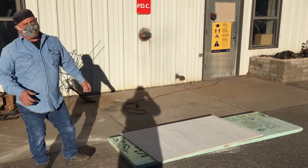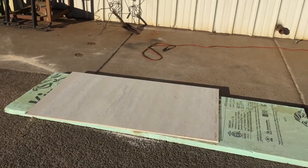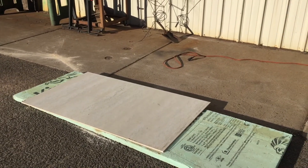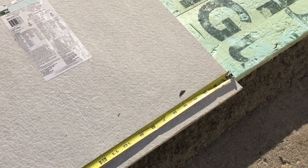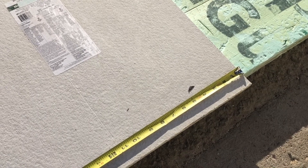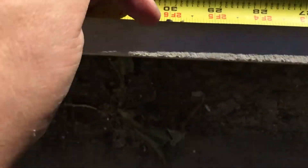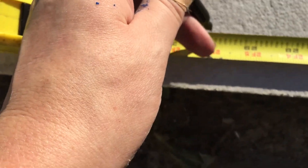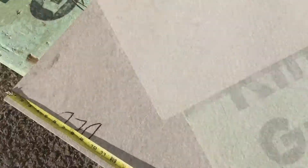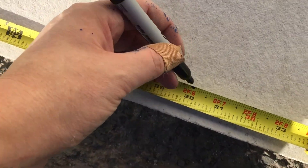So you see he drops it onto this piece of foam. A piece of foam would normally be sitting outside the sculpture studio, but if you need it at a time when I'm not there, it's just inside the gate, to the right, behind the bottles of acetylene. The first thing you will do will be to measure out 30 inches, which is half the size of your 5 foot or 60 inch board. Hook the tape measure on the end of the board, then find the 30 inch mark and make a line. You will move over to the other side, hook it on the other end, find 30 inches there and make a mark.